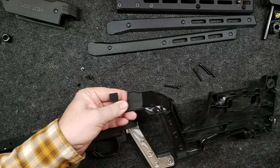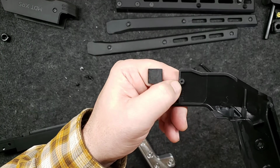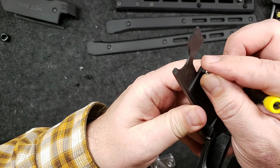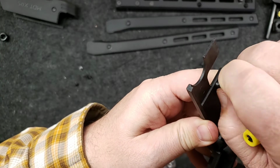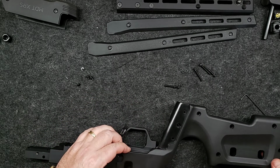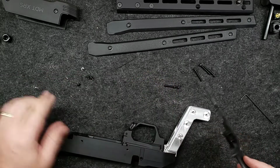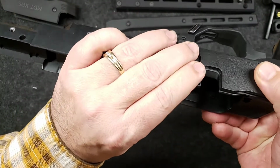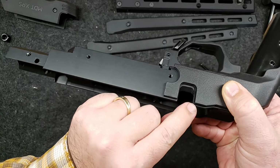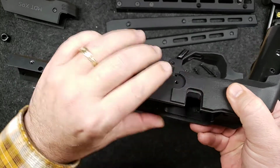This is interesting because this is what I was talking about earlier, having the nut go all the way through as these two halves were put together with the nuts. This is that kind of plastic stud I was talking about, and having something coarse threaded going into it to hold that could break down the road. And just looking at this, why they might have done that, I believe it is possible, and this is actually pretty good design principle here, that with this on the side, if you somehow got a piece of fabric or your sling caught in here, in between this aluminum and this outer plastic piece, I think there would be a tendency for this to break off or pull away from the aluminum.